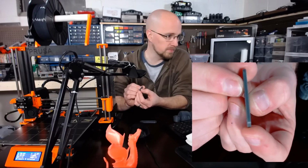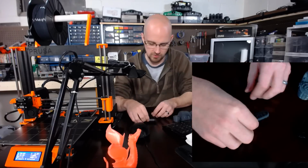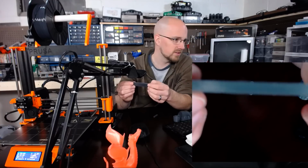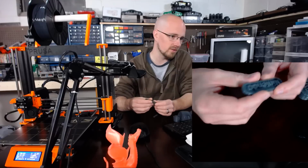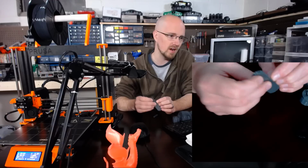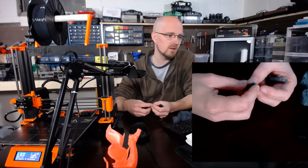It's almost impossible that I'll be able to show you on this, but there are some tiny little bubbles on the side. Again, the chances of me getting the camera to focus on it are almost zero. Maybe you can see them on this piece. No, the camera's not having it. But the fact that you can't see them there means they're pretty tiny, pretty insignificant. It looks like it's where the layers are starting, like it might just be a tiny bit of over extrusion. What would you suggest, Peter, if you do think it's that? Reducing my extrusion multiplier, or would you increase it?